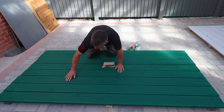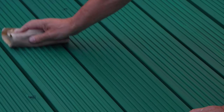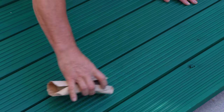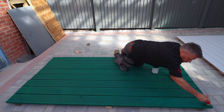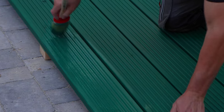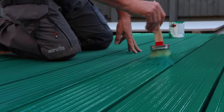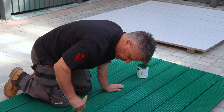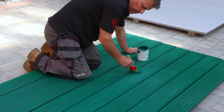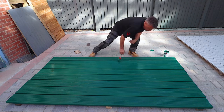Now back to the planks which were bare wood and had the first coat slightly diluted — rub your fingers across it and you may feel it's a little coarse on the surface. Just give it a gentle sanding down and dust off before applying your second coat. Once I've completed my second coat I'm going to leave this to dry for a further four hours before applying a third coat. The reason I choose to apply a third coat is because my first coat was diluted — the more coats you apply, the better protection you're giving it. If your painted decking area is expecting a lot of foot traffic it may be wise to add a layer of finishing coat or tough top coat for extra protection.